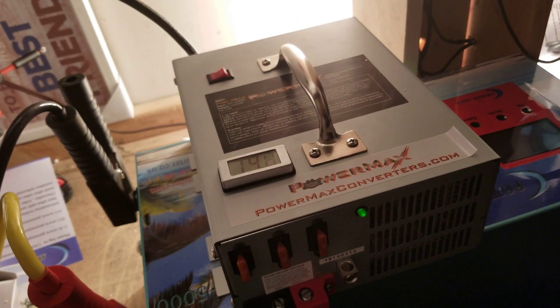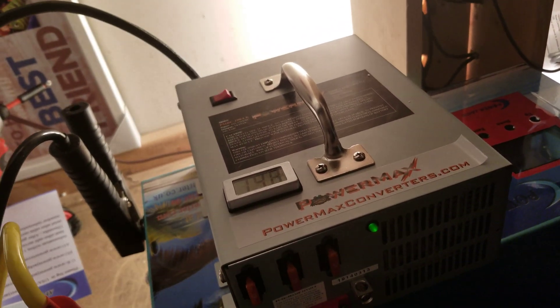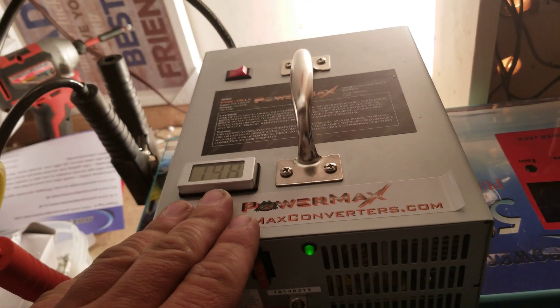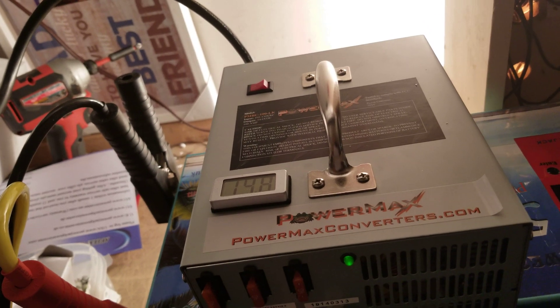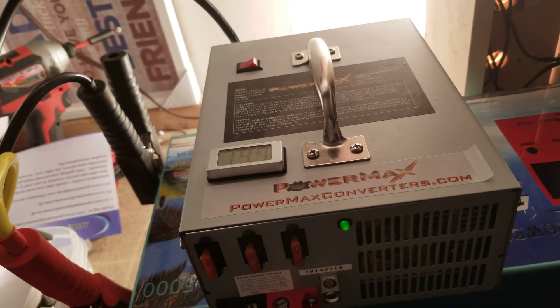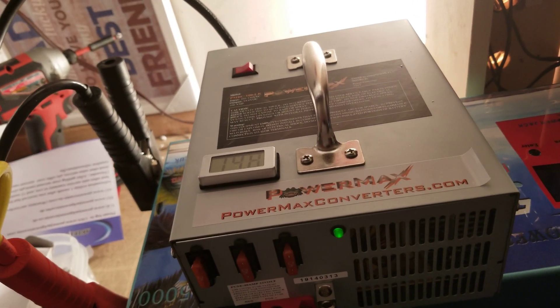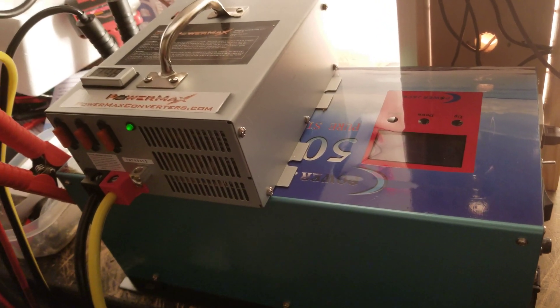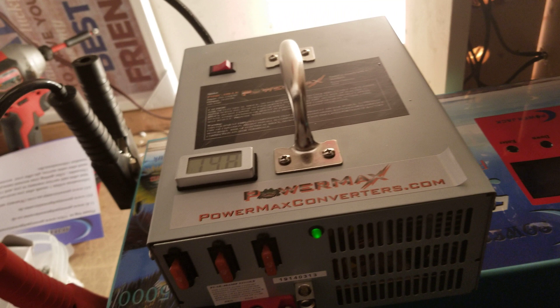Right now I'm running a load of about 820 watts. I've got incandescent bulbs — about 130 watts each — that provide the load I need for testing. I'll also occasionally use a small space heater or my heat gun, but these power supplies are not at all built for surge loads. Even the slightest surge and they pretty much shut down. So these are good for constant load testing but not for surge loads, which means I can't test surge on these inverters.